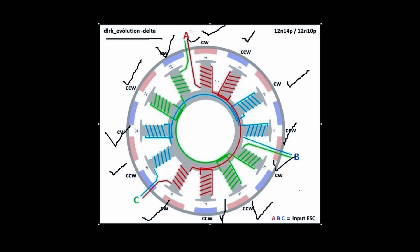If you look at this pattern, the starting points are at poles one, four, and five. All pairs of wires are coming out at the same poles, so it doesn't create any confusion about which wire should be paired with which one. In some other winding schemes, different wires start and end at different poles, which can create confusion. With this scheme there is no ambiguity — both wires come out at the same pole, so you just pair them and solder the signal wires.